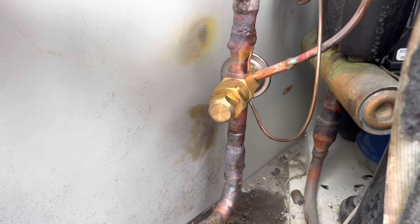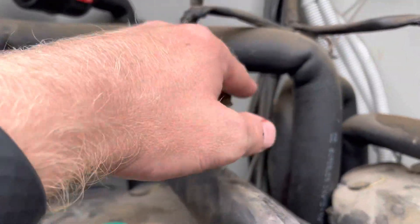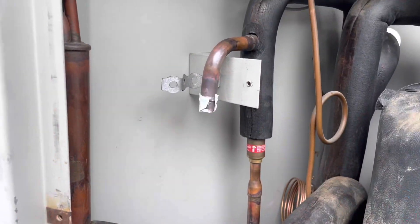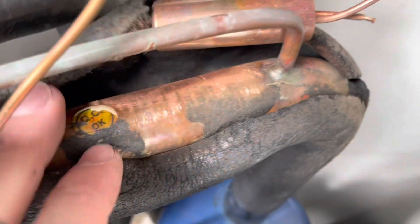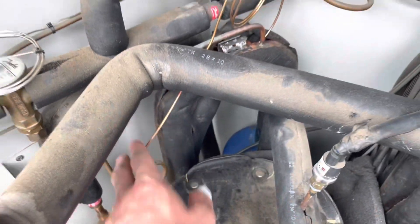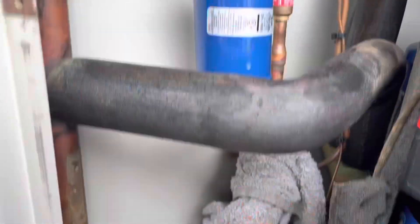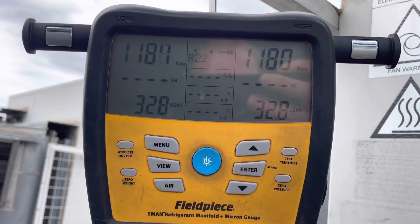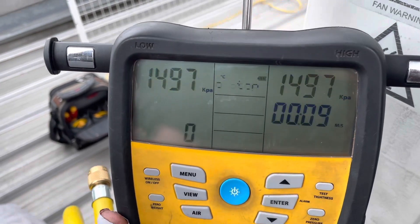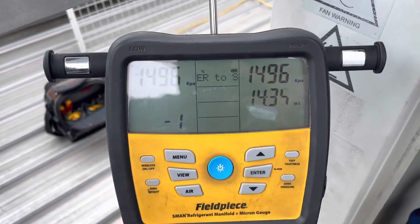TXV's in again - not the prettiest welds, but just doing a purge. Hopefully the dryer will be back soon. While we're waiting, I'm just cleaning up the pipe to strap the bulb to. Got that strapped in there and I'll run this line a bit nicer. Dryer's here - we'll get this in. Those welds are done and we're getting nitro into the system now to get it under pressure test.